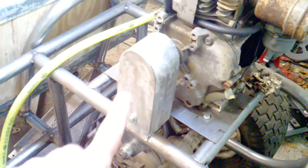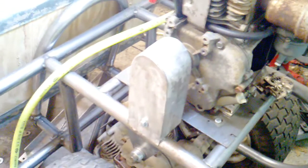Just took a piece of flat steel here, bent it around a tube, and then welded that to a piece of flat stock from the back side and welded them up. Then put a tab down here on this frame on the back side. You can't see it, but put a bolt through there to hold that on and it's pretty sturdy.